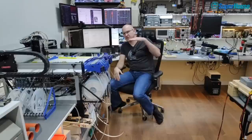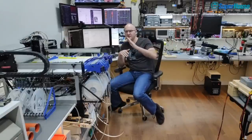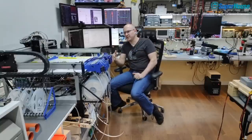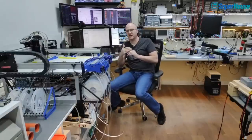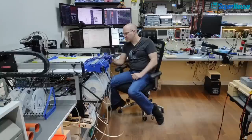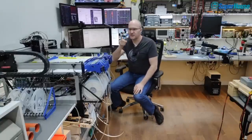It brings the temperature up to the soak temperature, holds it for a while, goes up to the spike, brings the temperature up to reflow, and then the cool down. And I've even attached it to a servo. So once it gets to the appropriate point in the cool down cycle, it uses the servo and pulls the door of the toaster oven slightly open so that airflow can get through and it cools down more quickly. But I stopped using that when I got this one.